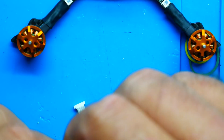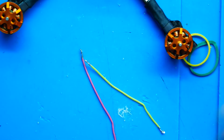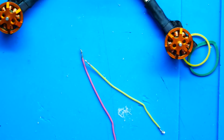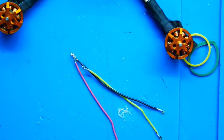We're going to take a power. We're going to take a yellow, which, I don't know. Make that your ground if you want to. Nope, we got a ground. Nope, nope, nope. We've got a black right here. So we're going to go red, power, yellow for S-Bus. S-Bus generally is yellow or green, so you're good there.